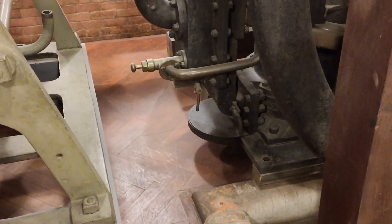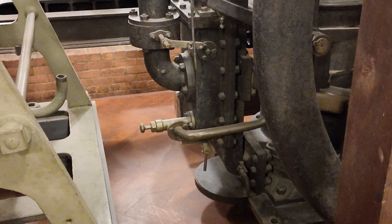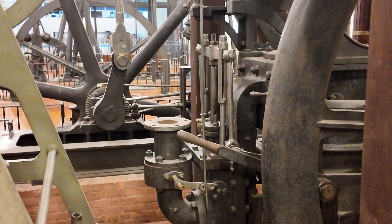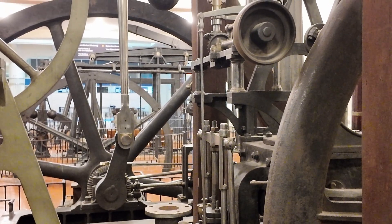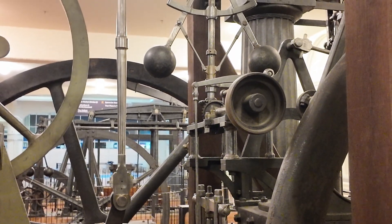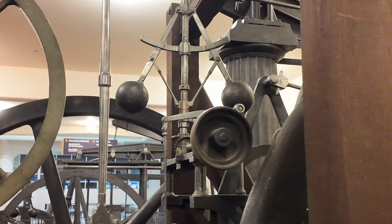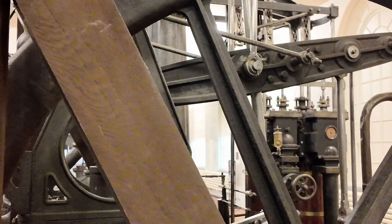The Grasshoppers were favored for their smaller size. These can run about half the size of a comparable standard beam engine, and it costs considerably less. The top beam had a whole lot less stress on it, and therefore it could be made much lighter and much less expensive. Despite that, this beam does show signs that at one point it actually did break and was repaired.